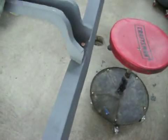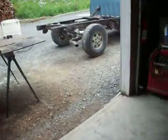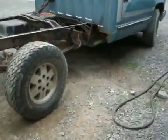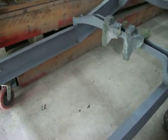I had to raise this bracket up a little bit on one side because it was sitting right on the angle of the truck bed. The angle I have there is one quick, hard, sharp angle, but the angle for the truck is more of a sweeping angle rather than one quick hard angle — it doesn't have a direct angle to it, it's a sweep. I didn't make that sweep because it would have been too hard to get this type of steel into a sweep like that in my shop, so I just made the angle.